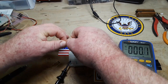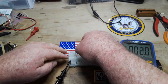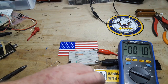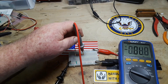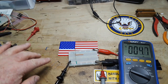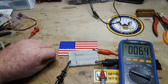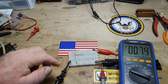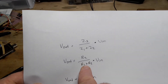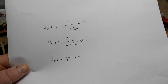Now we'll do the same with two 1ks — and we should see about the same, which we do, slightly slightly more. But the point I wanted to make is: the value of the resistors is not important to the formula. As long as they are matching, we're going to get that one half output.